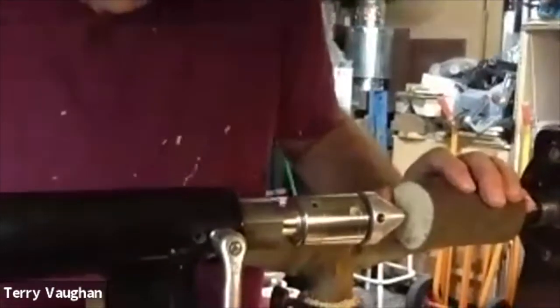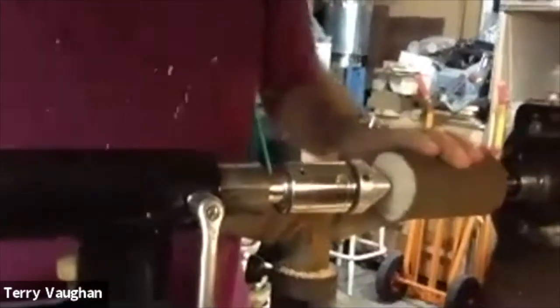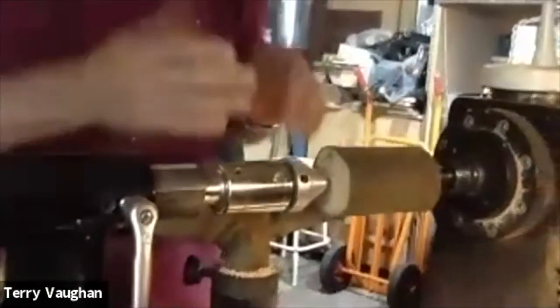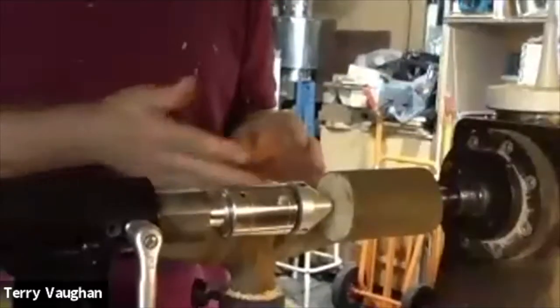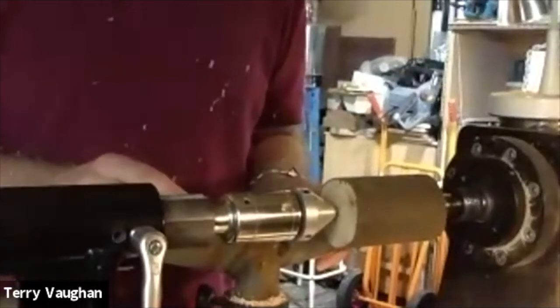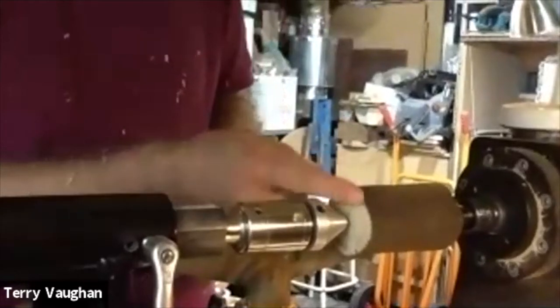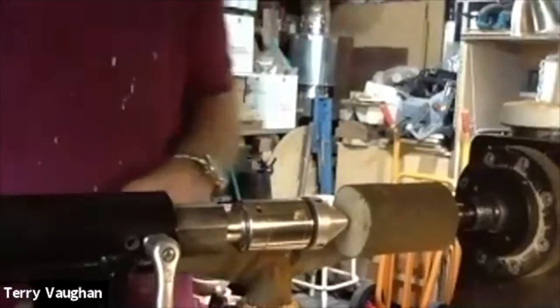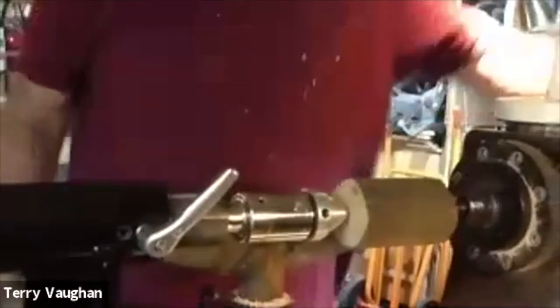Three-inch diameter — about two to four inches works fine. Give it a spin; you want it not too far out of balance. You can have bits sticking out and they make an interesting shape for the mushroom, but they're a little more challenging to turn. If you look at real toadstools, they don't have great lumps sticking out the side. This is going to be the cap at this end — you want that to be running fairly true, but not perfectly circular. Tighten up and that will turn all right.